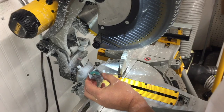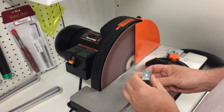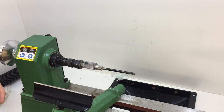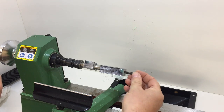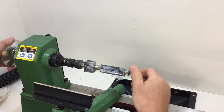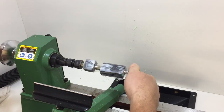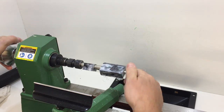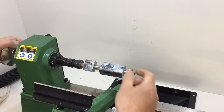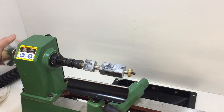Your goal is to get the tube the same length as the blank. If you want to fine-tune it, you can sand the end. There are also barrel trimmers you can use — I don't really use them but other people have success with them. You just want to sneak up on that brass tube so it matches the appropriate length and the pen kit works properly. After that it's time to mount it onto the mandrel. This kit comes with three bushings — that center bushing actually has two different diameters to it, which is neat. The goal is to turn the blank down to the diameter of those bushings, which match the tip, center section, and end cap.